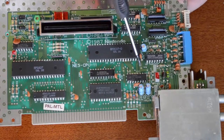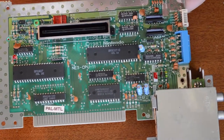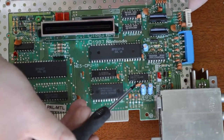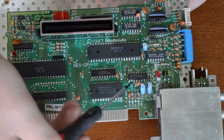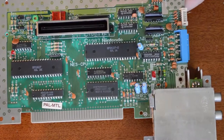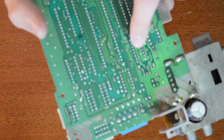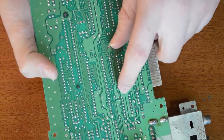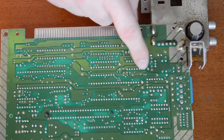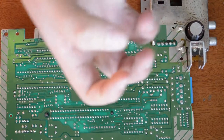What you're going to want to look for is what's called the CIC — it's printed there on the board. Here's the IC we need to take out. We need to remove pin 4, which is on this side, so we go 1, 2, 3, 4 — this one right here. That should be connected to 5 volts, which we can see from this little trace here. If you want to be sure, check it with a multimeter by powering on the console. Now we need to flip the board over — there it is. We're going to need to heat up this entire area with the soldering iron and then suck up all the solder. You may need to put fresh solder on first so it'll grip and suck out more easily.